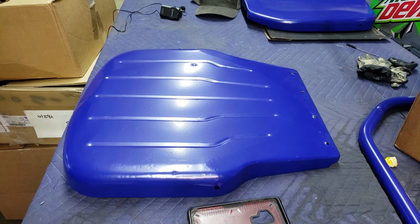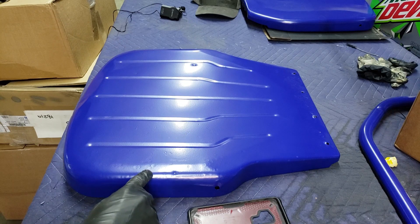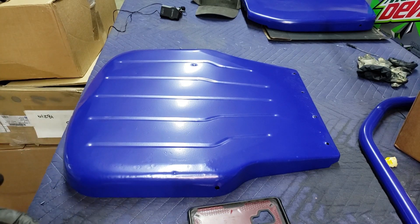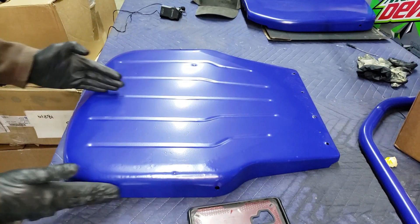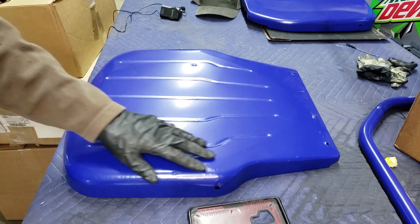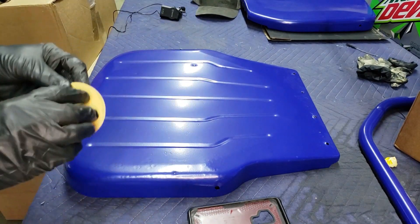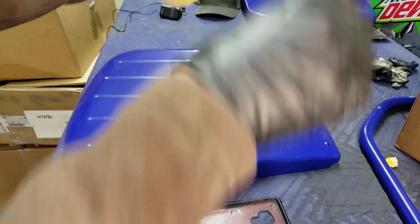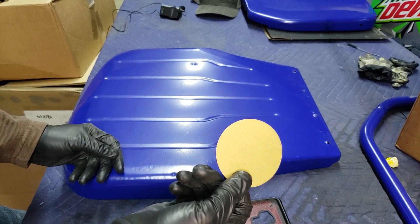In this shot it's very easy to see where we had the back ionization — these little round circles are basically the charge coming up and ruining your powder. It was just on this half of the part, so we're going to work on those areas first. We've got some 180 grit sandpaper — these are the big square sheets we have because we do wheel repair, so we have a lot of them for our three inch DA.